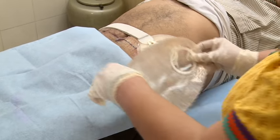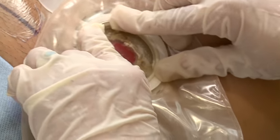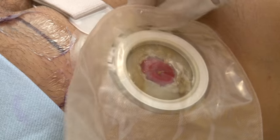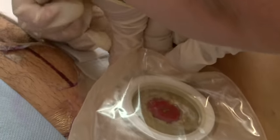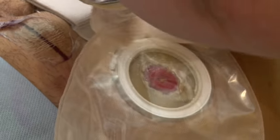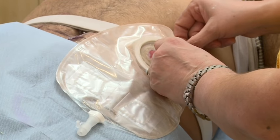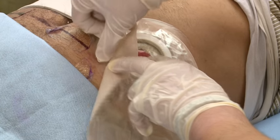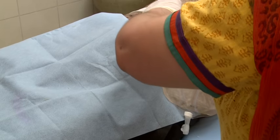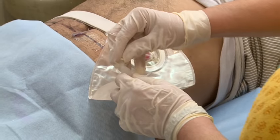Now place the coupling of the bag on the base plate, apply gentle pressure from bottom to top, and turn the lock ring to the wanted position. Check on all sides to make sure the bag is fixed properly on the ring. Rotate the bag with one hand on the base plate and the other on the lock ring tab — it should rotate freely when fixed properly. Close the lock ring in the most convenient position; a click sound is audible. Close the soft outlet also.